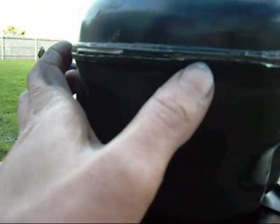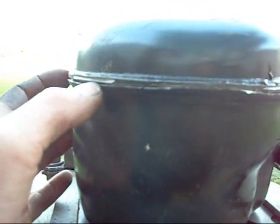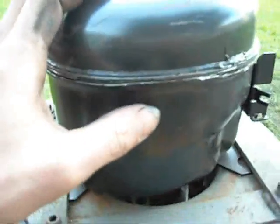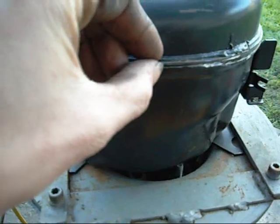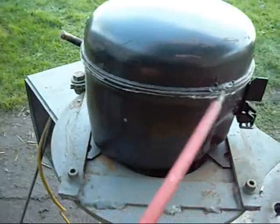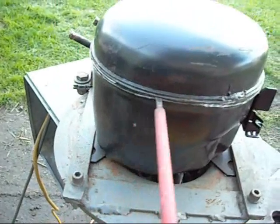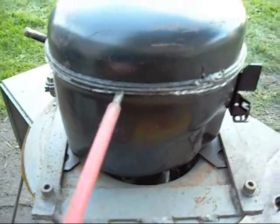The technique is basically just to run it around just below the weld line. You don't cut all the way through or you'll contaminate the insides with particles of abrasive and metal. If you cut roughly to the thickness of the welded metal on the outside, you can prise the top off afterwards. Of course I've already used compressed air to blow the dust out of that hole and minimise any ingress into the housing.